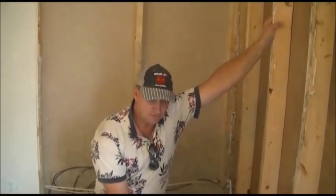I've had as much as a bathtub full of water and got myself really wet cutting it to get it out. What that does, when that water is in that floor, the moisture warps up the floor like you see, and can do the same on regular plywood. So get rid of the wet insulation and the water that's standing in the plastic. Now, sometimes you can cut the plastic and it will run all the water out, and you can survive that way.